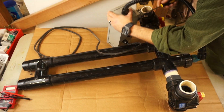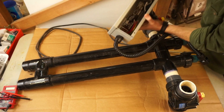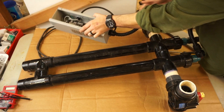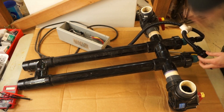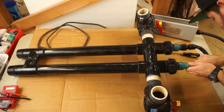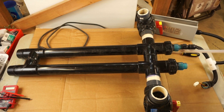I first break into the ballast of the Aqua UV. This is a client's UV that was taken off of a pond, so some parts are used and shown to be damaged, but I'm just using it as a display. This is the ballast. The ballast is housed in what is considered a fireproof, fire safety box. It sits external of the sterilizer, is not encased, and would not be considered waterproof — you would not want to get direct water on that ballast and would want to keep it out of a moist area to avoid moisture getting into the electrical. Here is the T5 lamp, a 57 watt lamp, pulled out of the quartz sleeve.